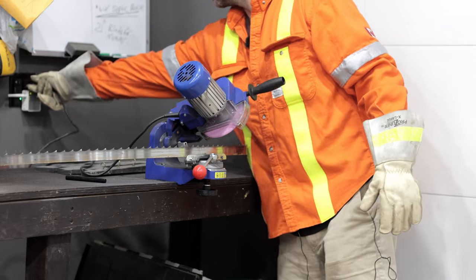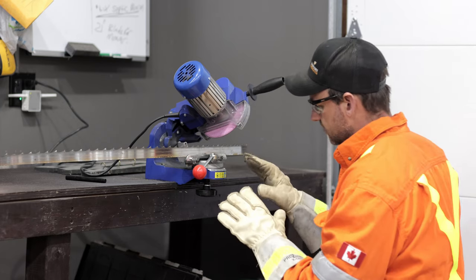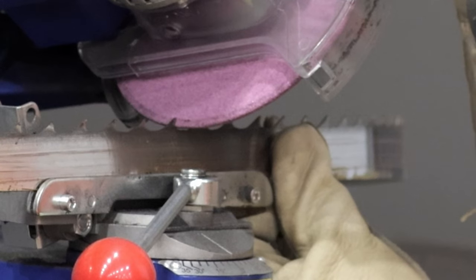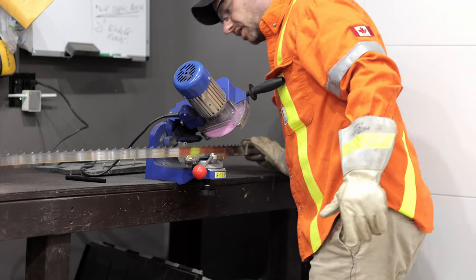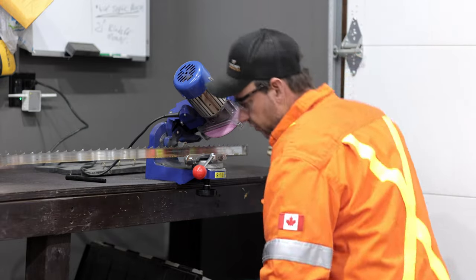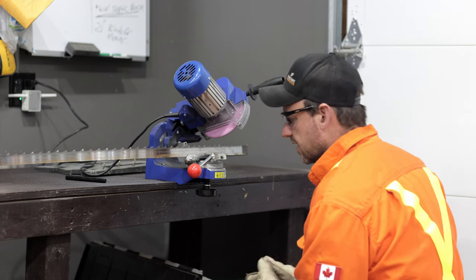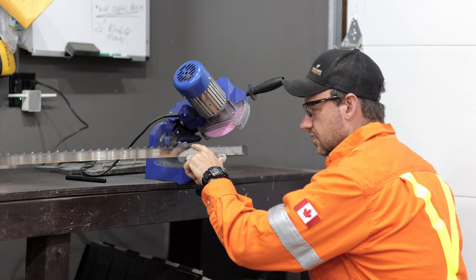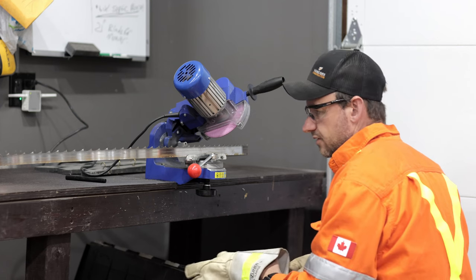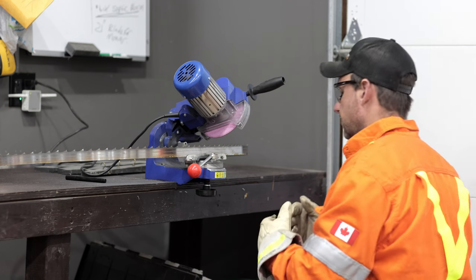I need a better setup because I'm starting to scratch my wall, but essentially my angle is pretty good — right between 50 and 60 degrees, so about 55 degrees, and I've been getting pretty good cuts like that. It's all manual with this thing — there's no way to advance it automatically, you just do it by hand. I can already see some worn teeth. I've sharpened this blade twice already, so this will be my third time sharpening it and I'm still getting good cuts.